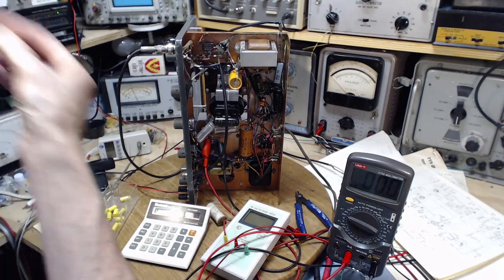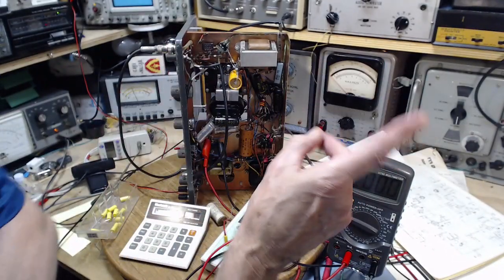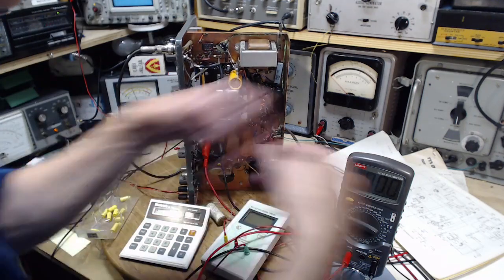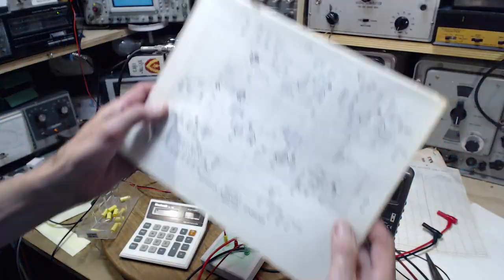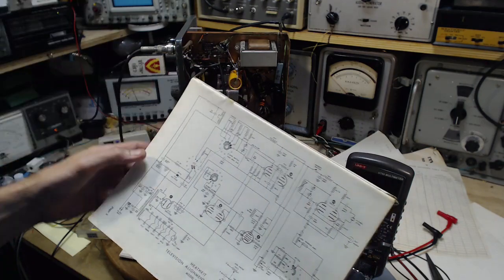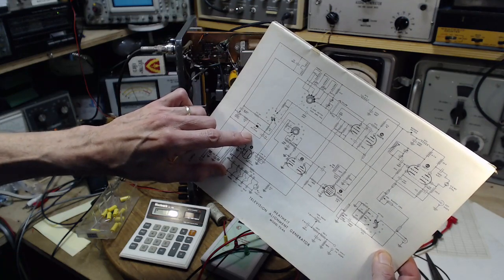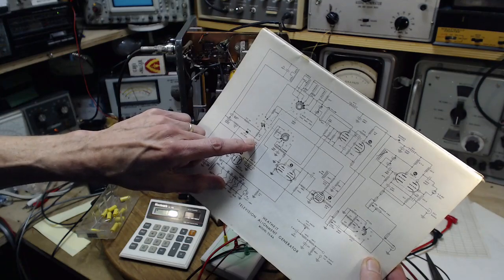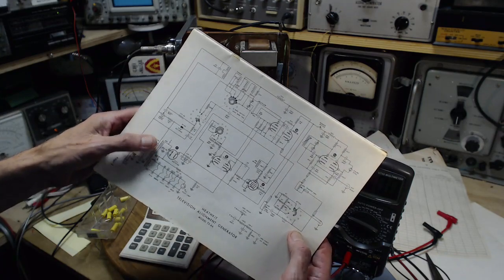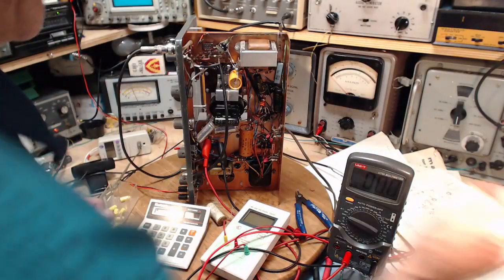As much as I really tried to prove all three of these big capacitors to be okay, there's only one here that can really cause this short circuit effect. That's the 40. So this is the 40 here. Why don't I just separate a lead and repeat the test? That would mean the current would be shooting through here. So assuming everything's okay, cut this lead, then we won't see this huge current here. But it won't be filtered very well. But will that really matter? Just probably reduce the effective voltage at this point. Let's try it. Got the lead.